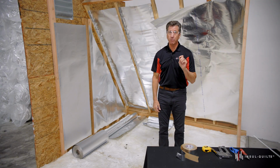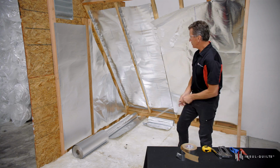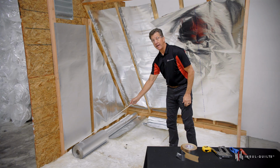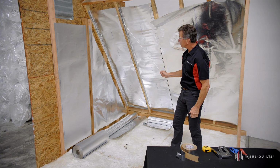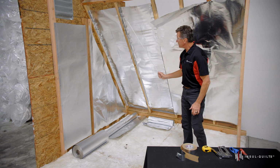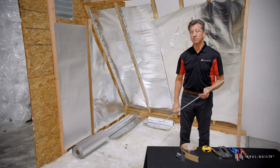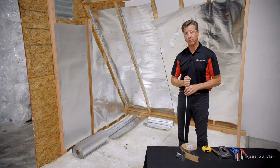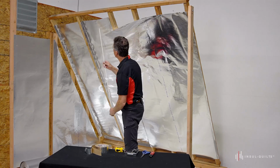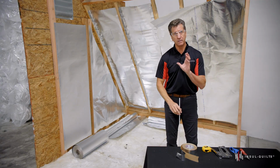The important thing about our product is the product options in terms of size are critical when you're trying to install this material. We have material that's 48.5 inches wide, as you can see the roll down here. We have material that is 25 inch flat to fit in either 24 inch on centers or on flat spaces. And then we actually have a flange material, 25.5 inch flange, that fits between 24 inch on center studs or 2x4s. And it makes it much easier to install, as many of the competing products only provide you 24 inches of material, and it's very difficult to staple a 24 inch piece of material when you have 24 inch on centers and you have to be sure that those studs are exactly 24, otherwise you won't be able to get the competition's product installed properly.